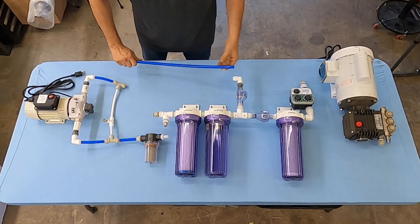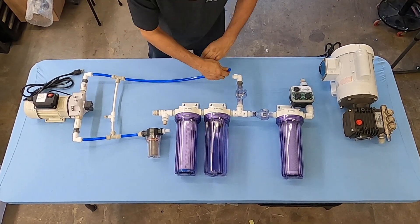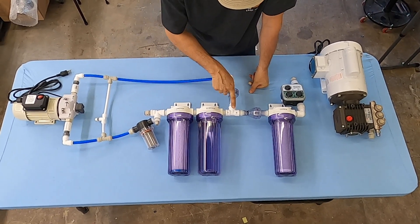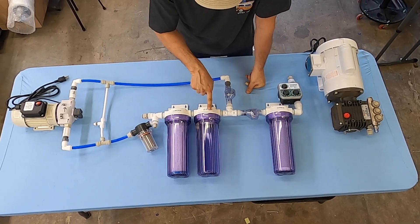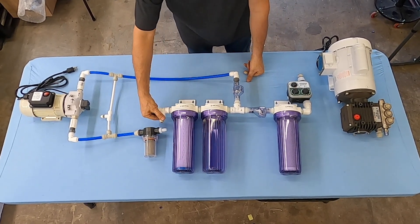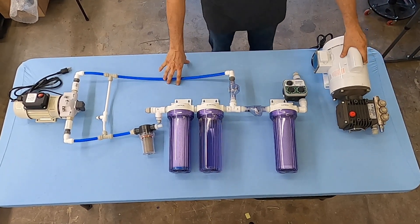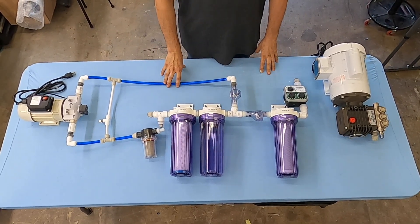The connection goes from the priming pump to number five, which is a check valve — a one-way valve. When we're sending seawater down this path, we want it to come to this T and not go back into the carbon filter. We want it to go through the 20 micron, then through the 5 micron, and from here we connect number nine to the high pressure pump with another blue hose. This concludes the priming pump and filtration connections. Thank you for watching.